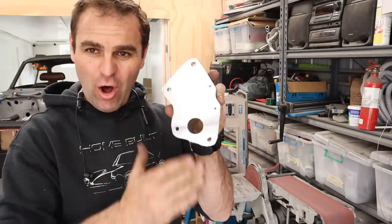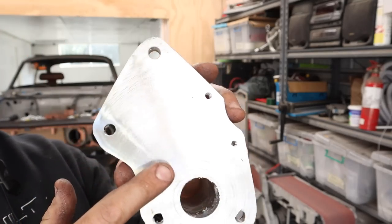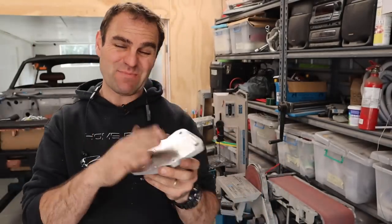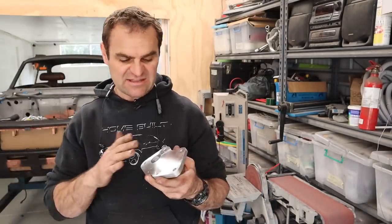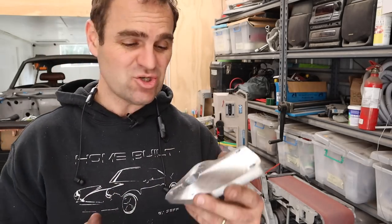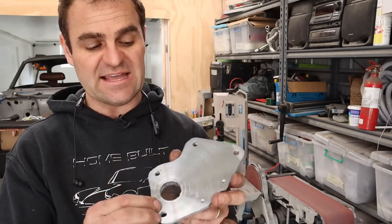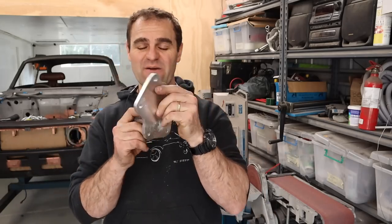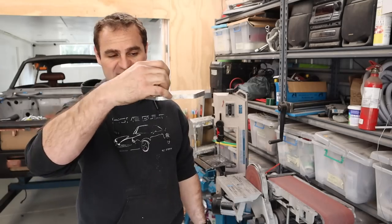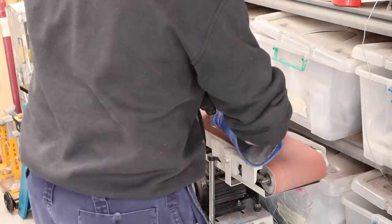I've got the whole surface skimmed pretty much on this piece, but it's not super flat. I don't know how well this is gonna pick it up. I was using a lot of WD-40 and I had the speed set as high as that lathe goes. I still get a lot of surface in this. I don't know whether I should be going slower, should I be going faster. I just don't know enough about using a lathe yet, but that is good enough for now. I'm going to finish it off on the linisher. It's nice and flat now, so I should be able to get that to just a nice flat, even surface on that. And then this part is done.